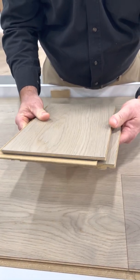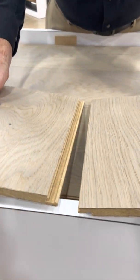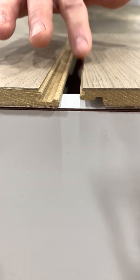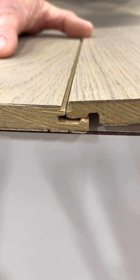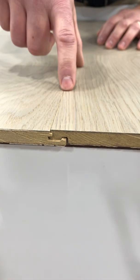What's really cool — I'll spin this around and set these down here — you can get a close-up of this dry fit profile and the way these pieces snap together. There's a long groove and a tongue, but just above that you can see another very small tongue and groove. It creates a double lock, so when this piece goes together, it's completely impenetrable to any liquid through this seam.